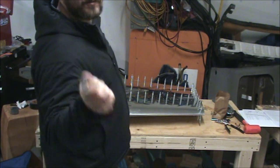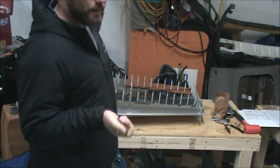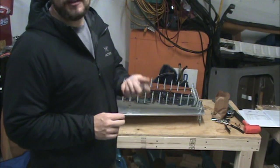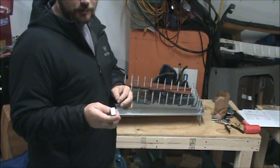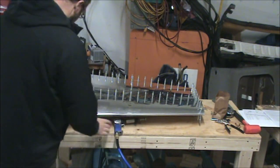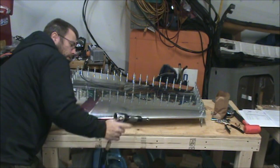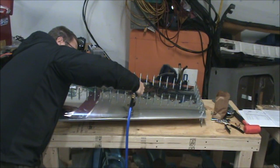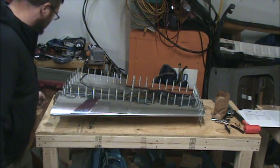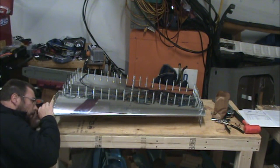I don't know if I covered this in other videos, but here again is the tungsten bucking bar that I bought. I'll definitely put a link down there. This is awesome. It's heavier than the bucking bars I've used in the past, which were all steel. It seems much, much heavier, maybe just an illusion because it's in such a smaller package. The awesome thing is that because it has all that weight in such a little bar, it's great for reaching up inside the vertical stabilizer. You don't need any special bar to do this. You just stick in the bucking bar you've been using on everything else, and it's got the weight to make bucking easy, which is probably one reason I've had to turn the gun down so much, because your bucking bar is doing all the work, and the heavier it is, the more impact it's going to have on that rivet head.